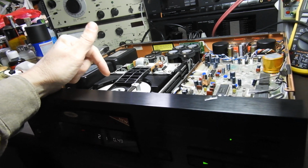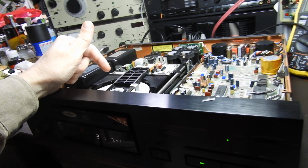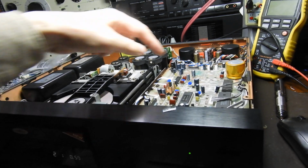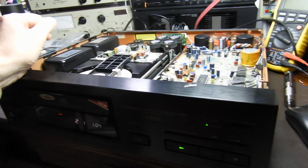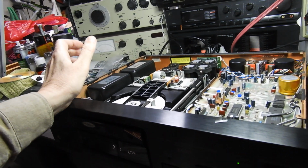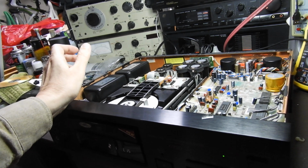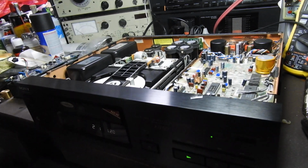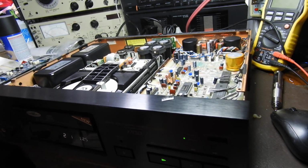And for not playing that CDR and having difficulty with some others distorting, I've just adjusted the phase lock loop frequency. There's a test point there and an adjustment of that pot and a slight tweak, and it now reads anything, and as you see, it reads fast. I'm not going to even adjust servo, tracking gain and focus, because it's fine, and it reads to 1.4, 1.5 millimeter interruption data layer, and the standard is 0.9, so it sort of reads 1.5.